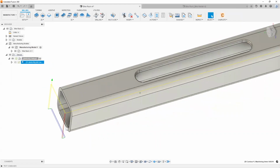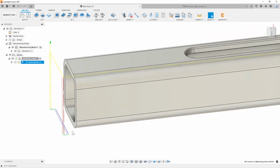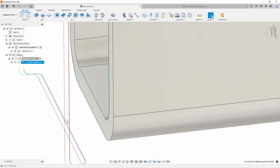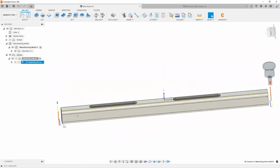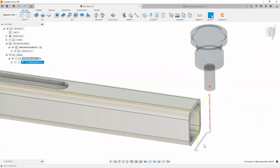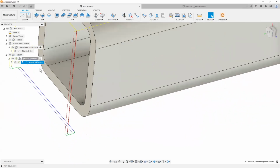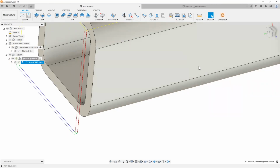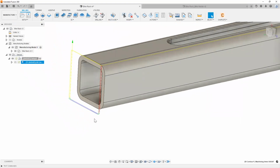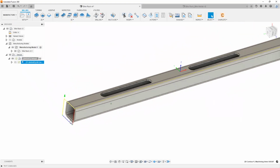As you can see, we have our first 2D toolpath right here. Our cutter is going to come in, make a couple of swipes, and then cut that final pass there for us. All right, and this happens on both ends because we selected 2 chains on either side. So like I said earlier, I want to show you why you would want to, for example, make this 0 degrees here on your leading sweep angle. And now, as you can see, we're spending a little less time trying to turn our tool into a part.